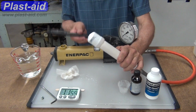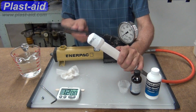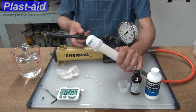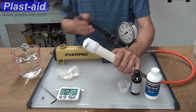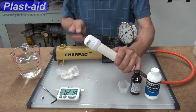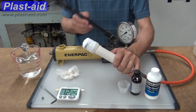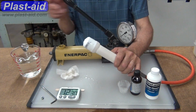The hose and the plug that's going to be on the other end is a 1/8 inch NPT, for National Pipe Thread, so it's a tapered thread. And so the idea is as you tighten it into the hole, it's tapered like a cone so that it seals. I haven't put any Teflon tape or any sealant on there. We're just going to do it without that sealant, and it'll end up leaking a little bit, but that's okay. We'll be able to see it get pressurized.